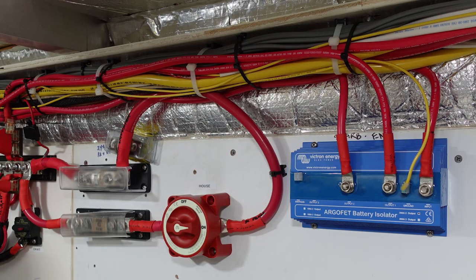You want to do that in a convenient location without having to go down to the engine room and open a hatch. Because when you do need to disconnect a battery, you generally need to do it right away. In the event of an emergency like an electrical fire, you need to turn that off immediately. So battery switches are located in a convenient location where you as an operator can actually turn them on or off.